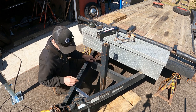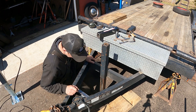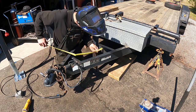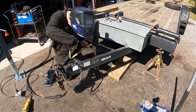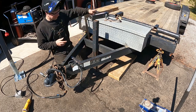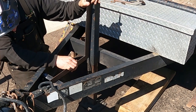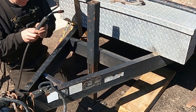I'm going to lay the framing square across here and here — that'll line this up. We'll get this tacked in place. I've got to get the welder dragged out close, get this piece tacked, and then fit the new jack in here and square that out. I've got the welder out and I want to tack the piece just in place so I can verify my dimensions. It's around square. To get my vertical line, I'm going to take this framing square and go like this — that's right on the money. I'm just going to tack this in a couple of places.